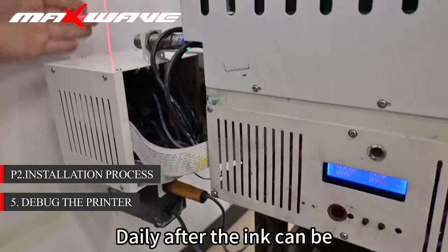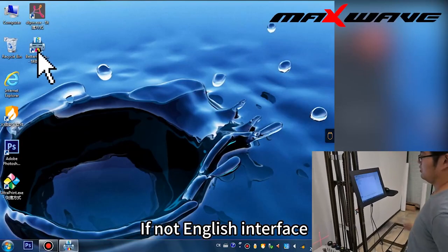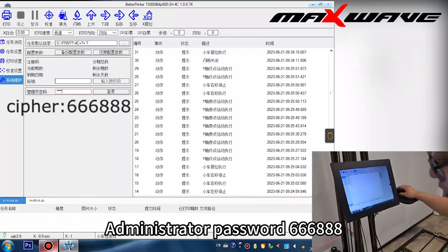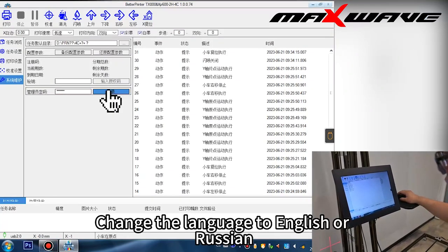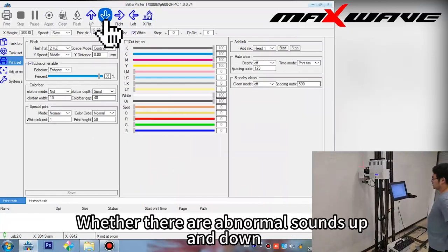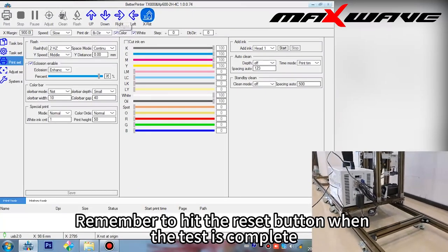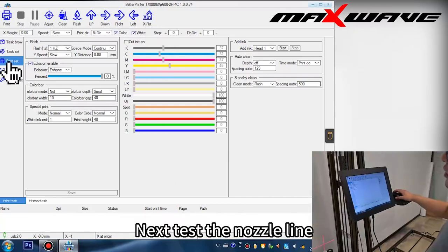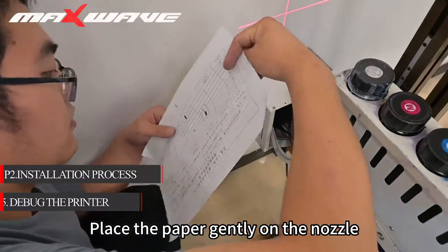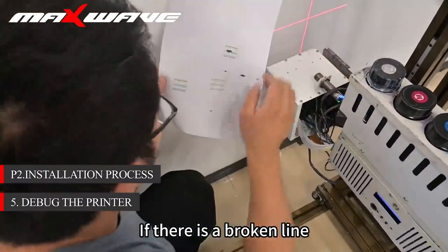Turn off the wall distance sensor switch and press the forward button to move the printer head 3 mm inside the wall. Daily after inking, use the ink blotter on the print head. Open Bat Printer. If not in English interface, here is the switching instruction — administrator password 666888 — change the language to English or Russian. Test the machine for any abnormal sounds. Remember to hit the reset button when the test is complete. Next, test the nozzle line.